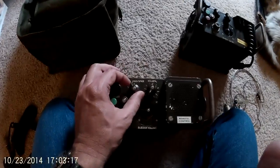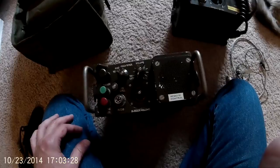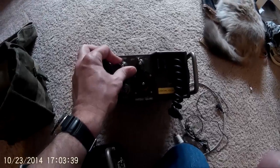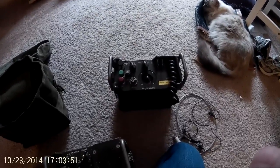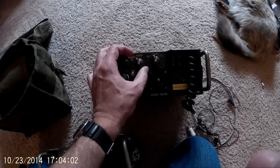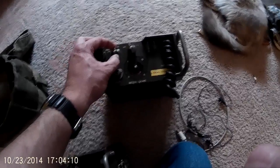You can just pick up the phone. If you're on the radio switch, which says radio, then you're listening to it. If you need to talk to somebody by telephone function, you flip this to telephone and crank the ringer. On the other end it will ring, and the guy there would pick up his phone unit plugged into the audio port and switch to telephone and talk — identify himself, ask what's needed, relay information like changing batteries, changing volume, sending replacements within the hour, etc. This automatically goes back to remote, and then you can go to radio function. The guy on that end can key up his handset and use it to talk directly over the radio as well, if necessary.